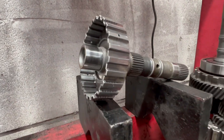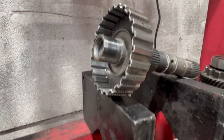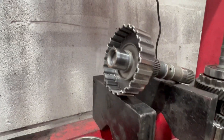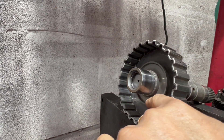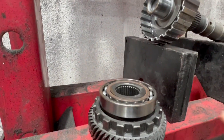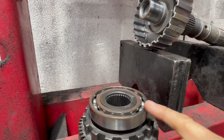This is the top shaft out of a TZ1A or a TZ1B, and this is the gear and bearing we just pressed off that shaft. It's important to note that the thrust bearing that seats here is retained — we need to use that again. We also need to use this bearing here, which the part number is a 6010.